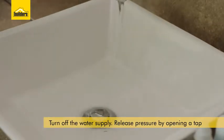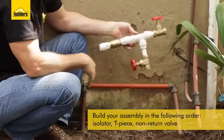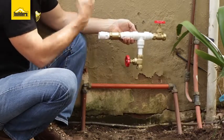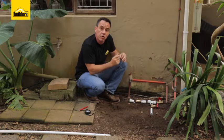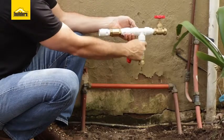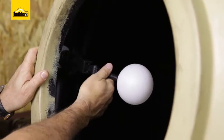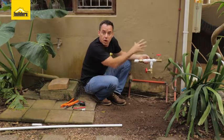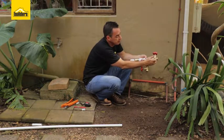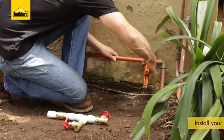First of all, turn off the main supply and open a tap to release the pressure. Then I'm going to build up this assembly and install it into my main line. There's my assembly complete — I've got the main line coming up through the isolation valve, all the way through the T-piece, through the non-return valve, and then feeding into the home. What that non-return valve does is it stops the pump constantly cycling the water through the house and back into the top of the tank again. I've got my T-piece tapping off before the non-return valve, so my main supply comes down through the valve and goes all the way into my tank, which is going to keep that tank full at all times whilst I've got main supply. I need to find out how much to cut out of my main line — I know my starting points, so I'll measure that, mark it out onto the pipe, cut that piece of pipe out, and then insert this assembly into the line.